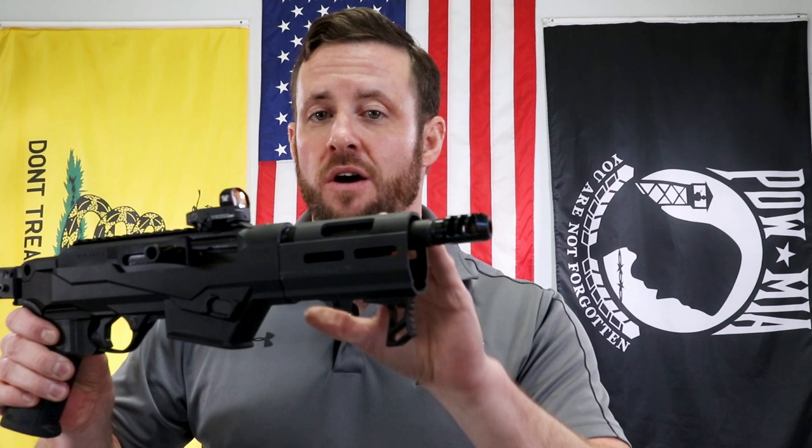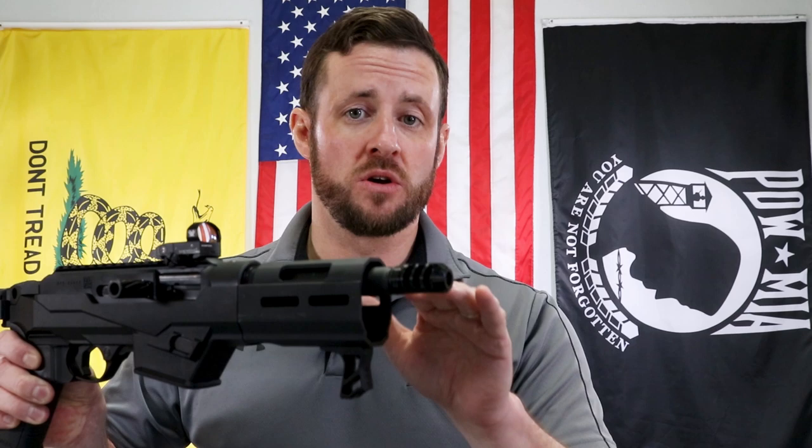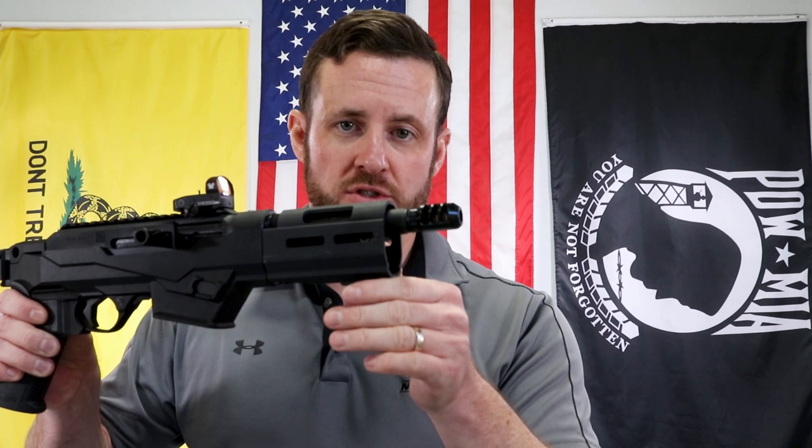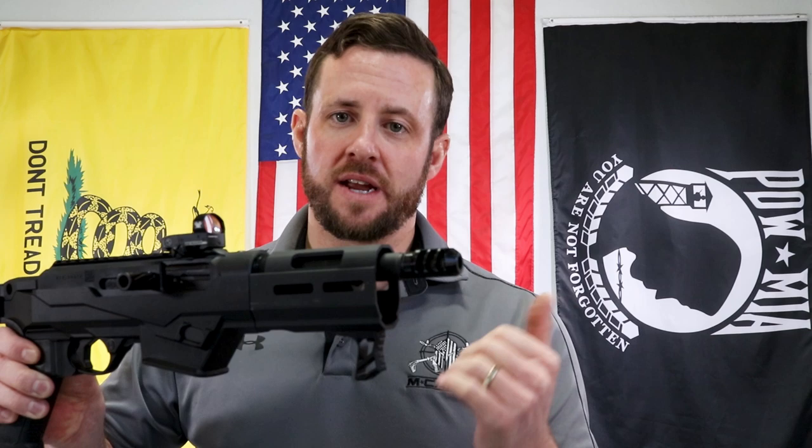In this video, I'll go over how to properly install this with the crush washer that it comes with, now for the 9mm and soon to be for the .40 cal. But for the .40 cal, we're still using the jam nut. It's pretty simple. You don't need a vise, but with the crush washer you do need a vise and some soft jaws. We'll cover how to install it on the Charger and on the PC Carbine - the Gen 1 barrel and Gen 2 barrel.